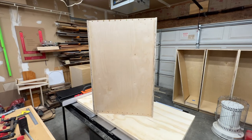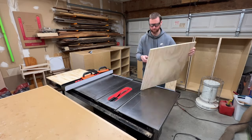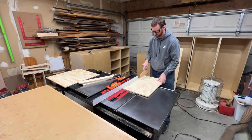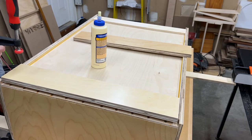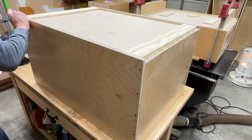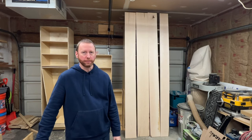I've got my cabinet boxes completed now, so the last step for this part of the project is going to be to cut some strips out of this half-inch plywood. I'll put one strip at the bottom, one strip at the top, and that will give me something to screw through into the wall when we mount them. Okay, we've got all of the cabinet boxes assembled now, so that's going to wrap up this phase of the project.